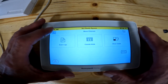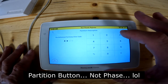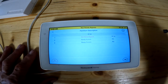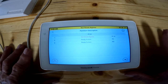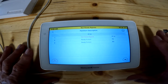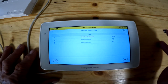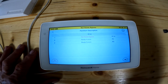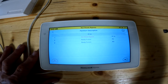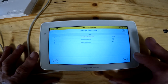The P1H button — I'm going to click on it and put in my master code. What this does is take you into your partitions and lets you know if each partition is ready or not. This particular panel will do three partitions. Most people don't use three partitions — if anything, you might have an office building with a service center or garage in the back. You could create partition two to let people in the back of the warehouse without letting them into the office area. You give front office people one code, back people another code, and you as the owner keep the master code to disarm both partitions at the same time.